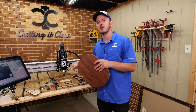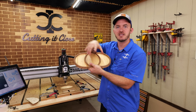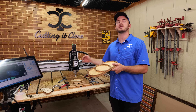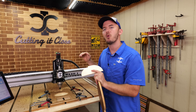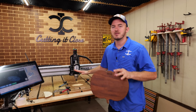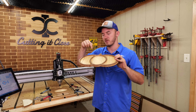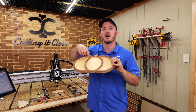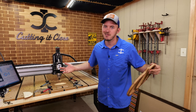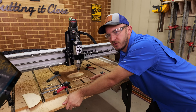The material we're using today is called Bam-X — a tri-layered material that changes color once you cut down about 0.15 inches, which works really well for trays. Whenever I start this, I'm going down 0.177 inches but I pay close attention, because if it goes even slightly too deep I'll stop it and raise the Z height. We do this when making batches of 100 of these on our industrial CNCs — we watch the first couple toolpaths to make sure it's not digging in too much, because that means a lot more sanding at scale.